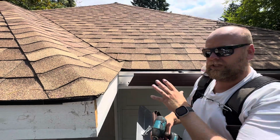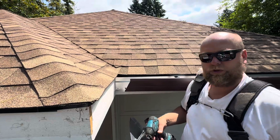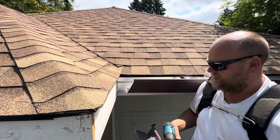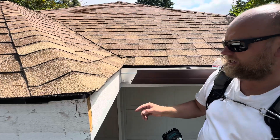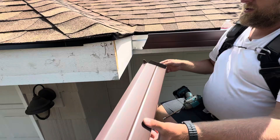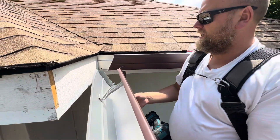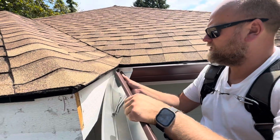Alright, beautiful day. We're going to be showing you how to do an inside miter without any miter strips. Basically, we have a clean 45 cut on this end, and this gutter has a tab on this end. So what we're going to do is connect two gutters together.